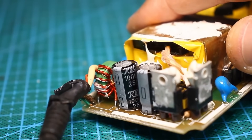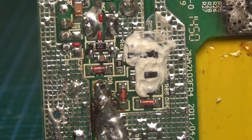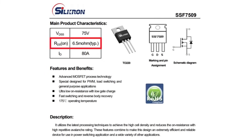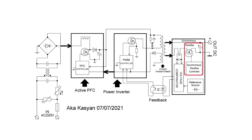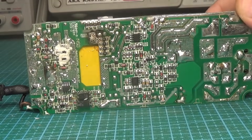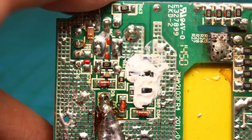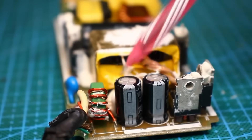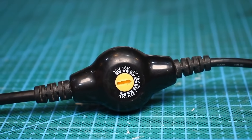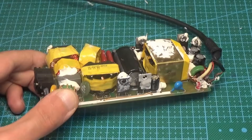The output part of the power supply is also classic except for the synchronous rectifier: two powerful N-channel MOSFETs — SSF7509 — with an open-channel resistance of 6.5 mΩ and a dissipated power of 200W. The manufacturer added a second identical device in parallel. The synchronous rectifier MOSFETs can be controlled by a simple circuit, an additional winding, or specialized ICs that monitor the transformer's output. One concern is the use of 25V capacitors at the output — with this unit capable of outputting 24V, there's practically no margin. Total capacitance is 2000 µF, which may be a bit low depending on operating frequency.